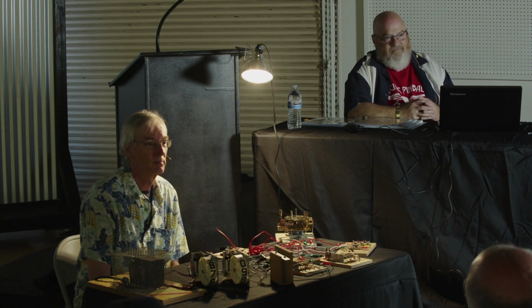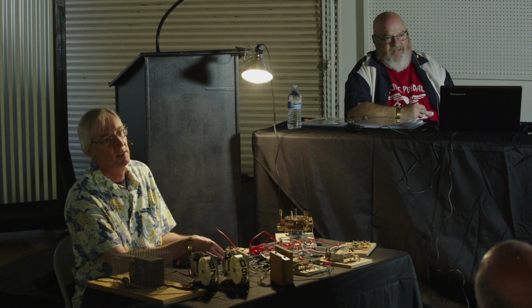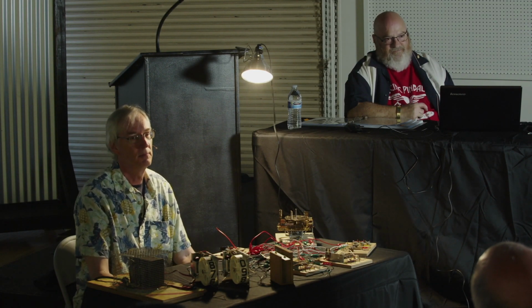Just a comment with regard to the 9th position switch. Like you said, it has to overcome a lot of resistance, and the tension on those blades, for not just the 9th position blade, but the other 2. If it's pushing back too hard, even if you've got a well-cleaned switch and very little lubrication, folks, it's the curse. But just the tension on the blades, a fine balance of, yes, I want it to push this far, and no, I don't want it to push back my cam, which raises that 9th position arm, to push it closed.